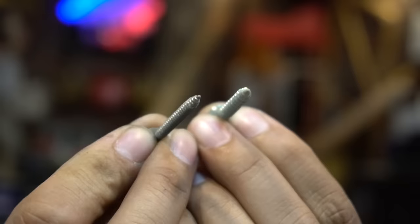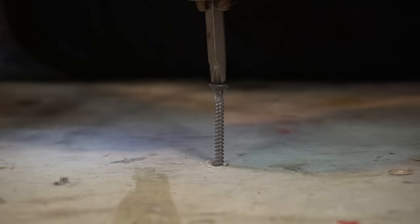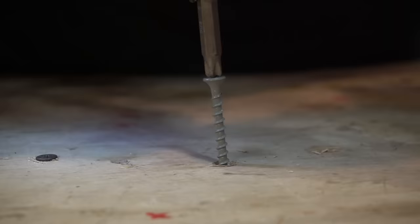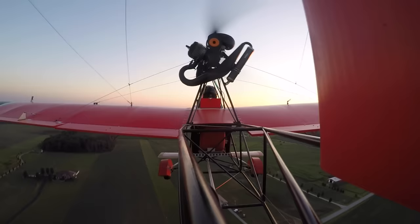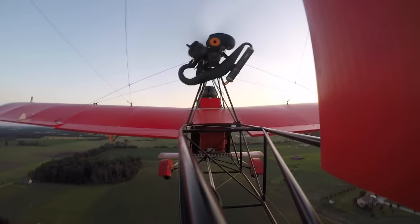So with that, you set your blades at a certain pitch, because if you imagine you take a screw and you have a fine and a coarse thread. Now if you run them both at the same speed and stick them in a piece of wood, the coarse thread goes a lot faster and the fine thread takes a little bit longer to get there. Now this is kind of like a fine thread propeller. So when I hit 45 miles an hour, the plane has to turn that engine so fast to make it go anywhere, to go faster and climb. Because my plane wants to climb around 45 to 50 miles an hour, and that propeller is, meanwhile, fully open, so it doesn't want to climb.